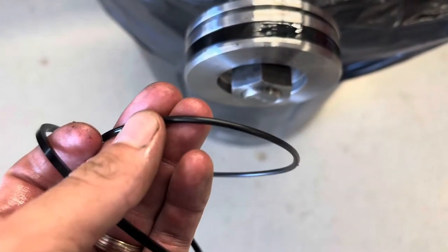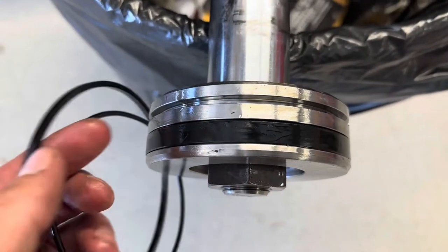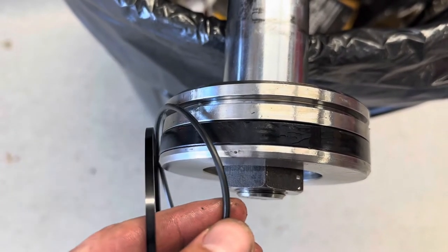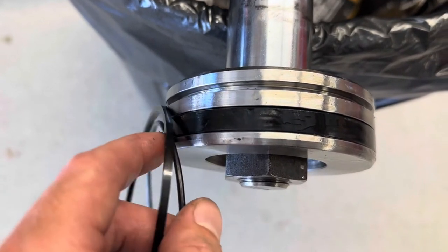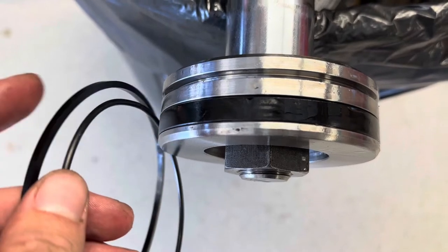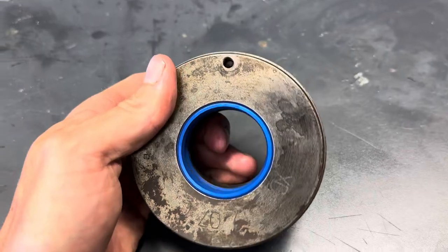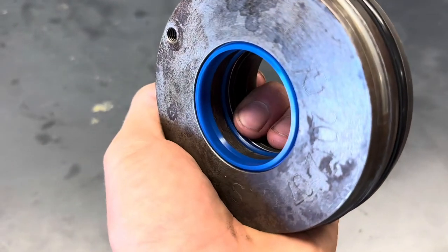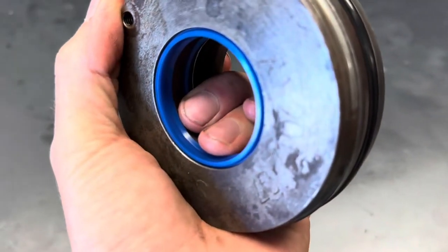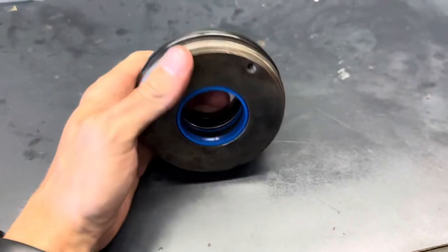After cleaning that out, I put the new ones in. I placed two seals aside because I felt like I had an extra one. The rubber round one goes in first to fill the hole, and then the flatter one goes over top. I got all the new seals put back in. The middle was corroded so I had to get all the debris out. Got the front one and the rear flat one — the outer two. Now I'm going to reassemble and check for no more leaks.